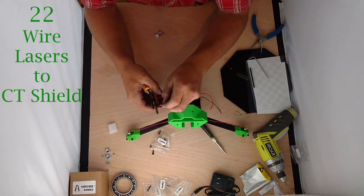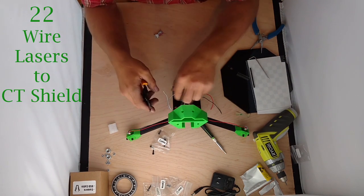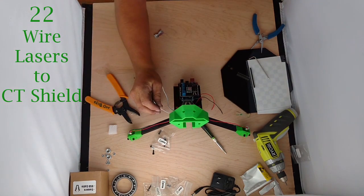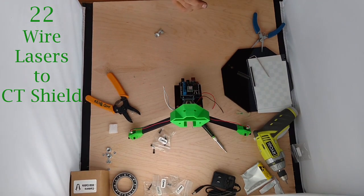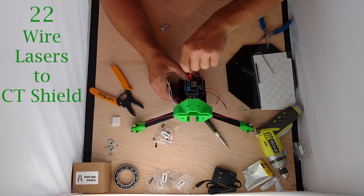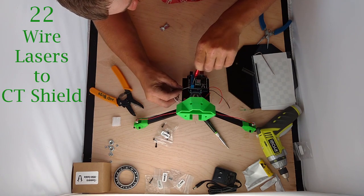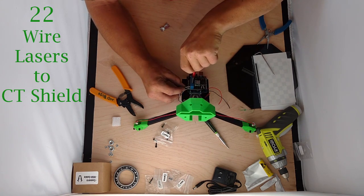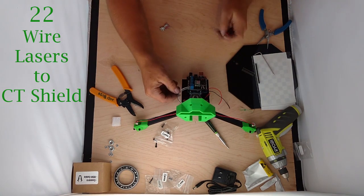There's not a lot to clamp on these, so I'm going to take my electrical pliers and just peel back a bit of the insulation — that should give me a little more room to work with. Now take the small flat screwdriver, open those terminals up, insert the ground and tighten it down. Same thing — open it up and tighten it down. So that is done.